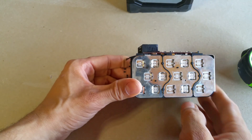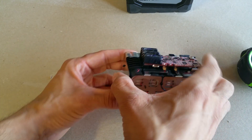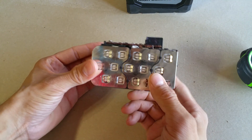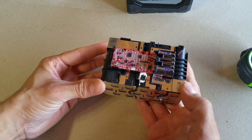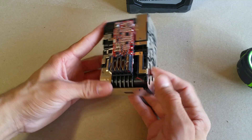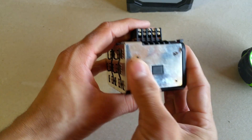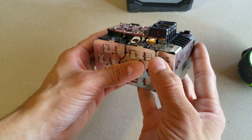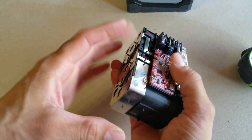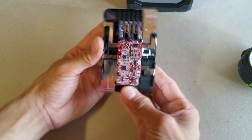The configuration is similar to the DeWalt — not pack-pack-pack, but more like a pack, a pack, a pack. So the long story short: it's basically three 3.0 compact packs joined together to make a 9.0. You can't really open it much further than that. There are no switches — it's just 18 volts, which is not a bad thing. You can see the battery bars wrap right around, and there's a cooling section here — like a little miniature heat sink — so any built-up heat can be shed off.